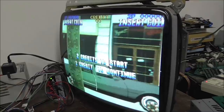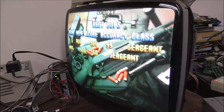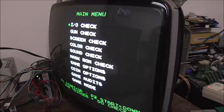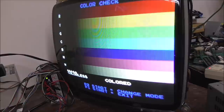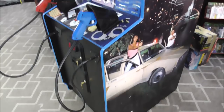After looking around a little bit, I noticed that the main screen was blue instead of red, and I remembered that whenever we swapped this one it changed the color. So I checked all of the pins on this one just to be sure, and pin 9 — pin 9 is supposed to be connected on all of them and it was not, so I had a problem with that pin. I also found this one up here, G6, that is the same type of chip — a 74LS151 — and it had the exact same problem: pins 5 and 6 were dead. So there are several of these same exact chips on the board, and some people would argue they're all going to go bad — we had three fail on the same board.